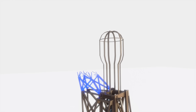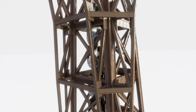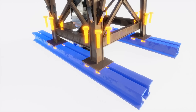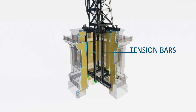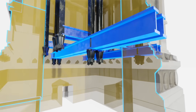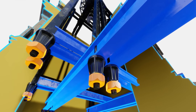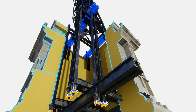Eiffel designed a supporting structure for the hand of the statue using girders fitted to the main columns of the central pylon, kept on the pedestal. A long journey of tension bars connects with a set of lower girders embedded in the pedestals. By tightening the huge nuts of the tension bars, the entire iron structure of the statue is bonded firmly with the pedestal.